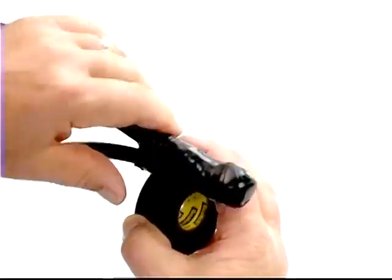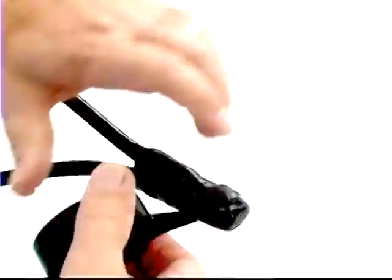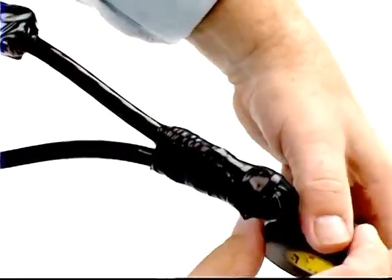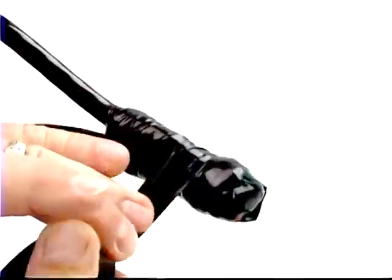Start taping with Scotch brand premium vinyl electrical tape. Pull the tape roll so that the vinyl tape goes on with tension, squeezing the rubber tape below. Half-lap the tape. As you did with the rubber tape, you'll need to wrap diagonally to cover the splice end. Wrap to the conductors, covering the rubber tape and taping at least one inch onto the cable jacketing.